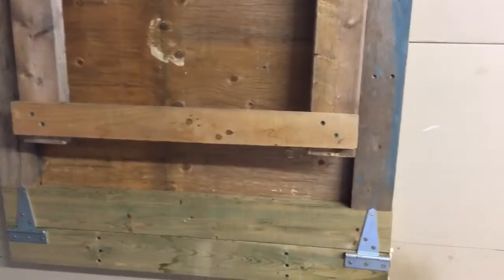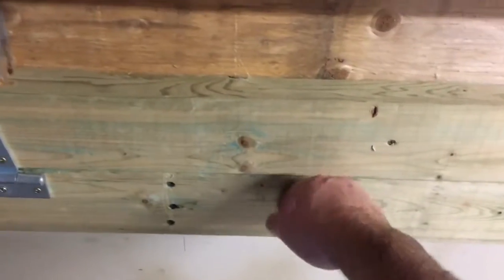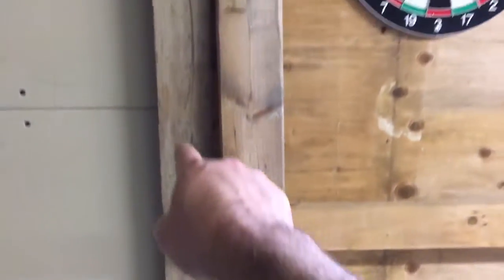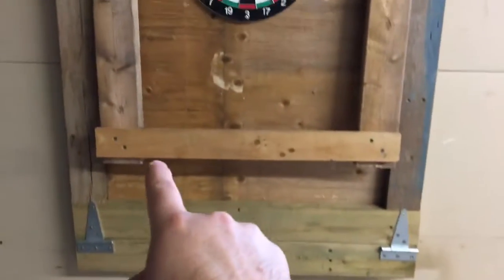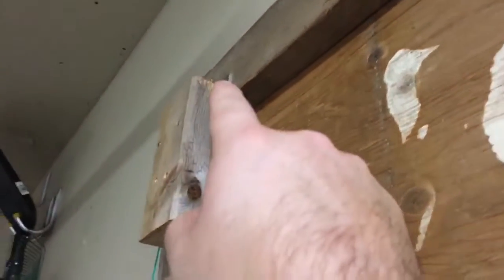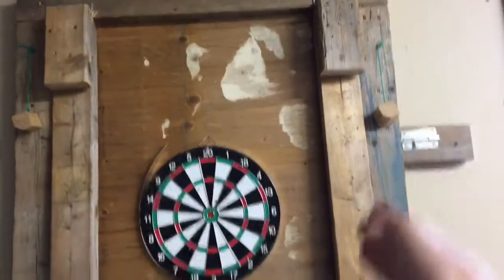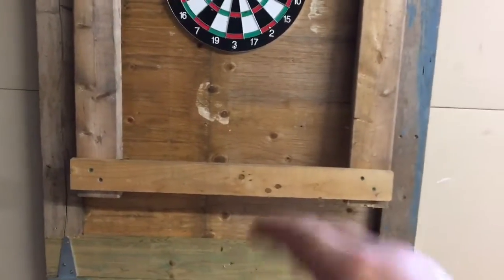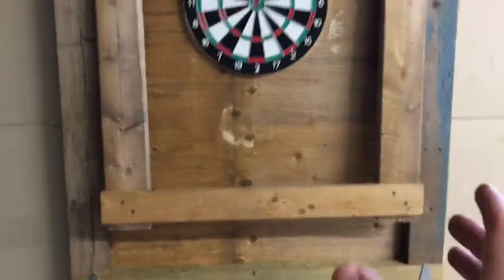So after you find your tabletop, then you frame it in with some 2x4s, because that's what you're going to hook into your support beam here, as I did right here. So you frame it in all the way down. Then what you want to do is get some articulating legs. Now if you attach your legs together, these are on hinges. If you only had one on a hinge, it's very loose and it wants to wobble this way and that. That's what you want to prevent, and that's why you find the 90 degrees, make sure it opens well, that there's no rubbing, that it doesn't get stuck, and then you just tie them in together, and that's going to add some stability.